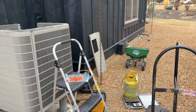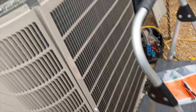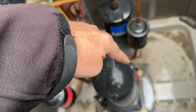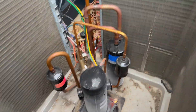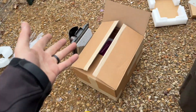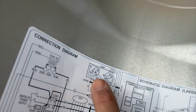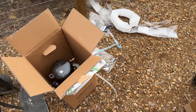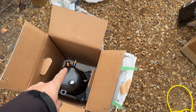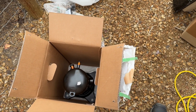Here's our new compressor - high voltage plug. This is our old one - high voltage plug, low voltage plug. I called Carrier and said hey, you gave me the wrong compressor. They said nope, that's the right one, it's not superseded. I asked if there's an upgrade kit - nope. Can I run it without that plug? The instruction manuals say nothing about it, and if we look at the schematic there's only one plug, not two. Clearly that's the wrong compressor. They told me to call tech support, which I did, and they don't answer.